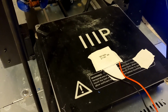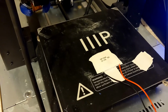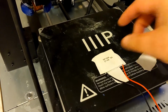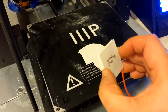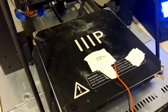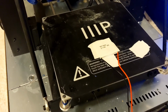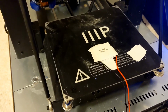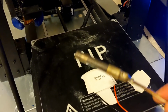So in the case of barbecue, for example, you could put it on the door. I don't know whether you're familiar with the Smoky Mountain Weber smoker. So you have the door. You could attach the heat side of the TEG to the door, and then put a heatsink on top of it, and you'll get all the power that you need to do a measurement to monitor temperature inside your barbecue smoker without any battery at all.